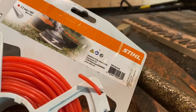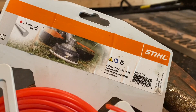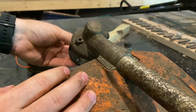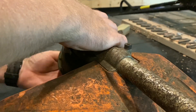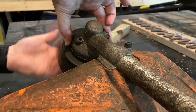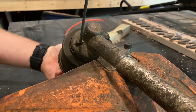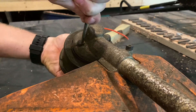This is the string I use: Stihl 2.7 millimeter, or the 0.105. To put this back on, you're going to line up the splines. Remember, the threads are opposite and this is hand-tighten only. You'll put the file back in to hold it, and tighten it just the way we untightened it with the wrench — just hand tight.